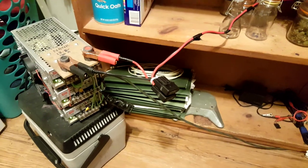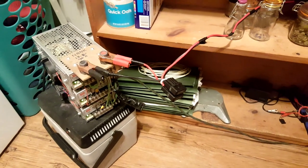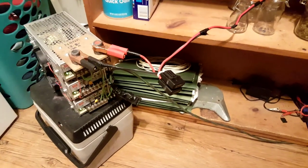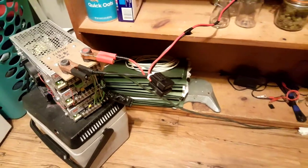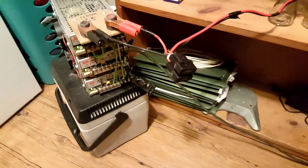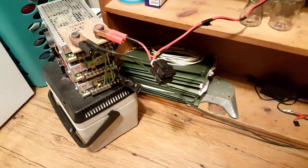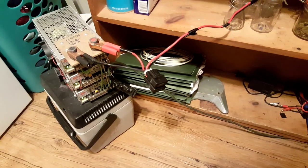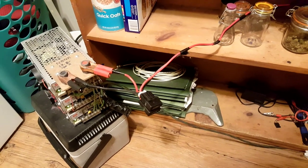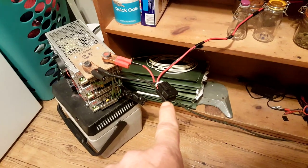The fuse contacts need to be cleaned — maybe with a soft brass wire brush, or better yet a pencil eraser and some contact cleaner. It's a failure point. After sending those carriers the fuse block was quite warm to the touch. After reseating the fuses several times the voltage drop was as expected. That fuse holder is a huge failure point.